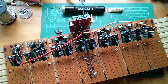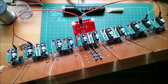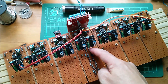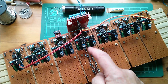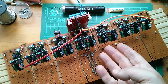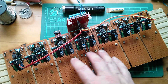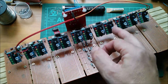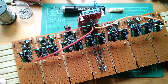Now if you're thinking those bar graphs look very temporary — yes they are temporary. They're not going to be there forever. They're going to be there until I add on the rectifier and smoothing op amps, which will then be able to drive an LM3915 10 LED bar graph, which can be put into dot mode. And I think I'm going to have to put it into dot mode, otherwise the five volt draw will be enormous. The LM3915 is the bar graph chip I want to use, but what's nice about these ones is that they have rectifying and smoothing circuits in the chip, so I've been able to sort of build this preliminary version of my spectrum analyzer.